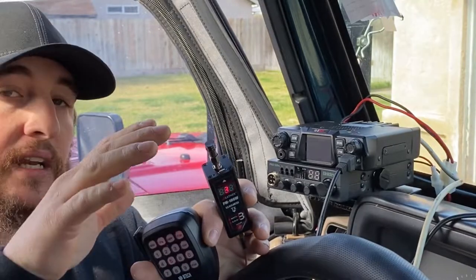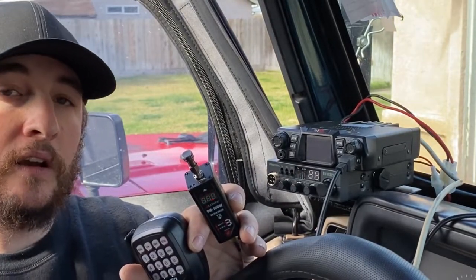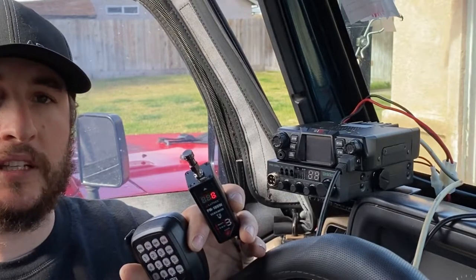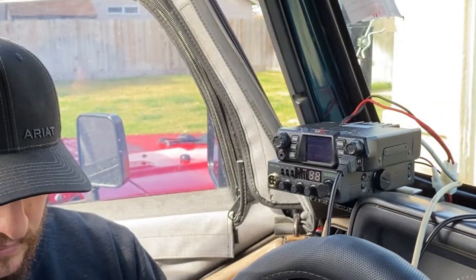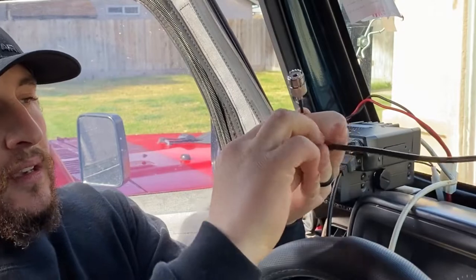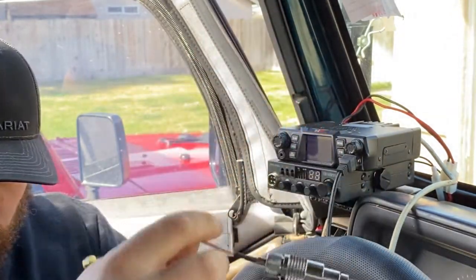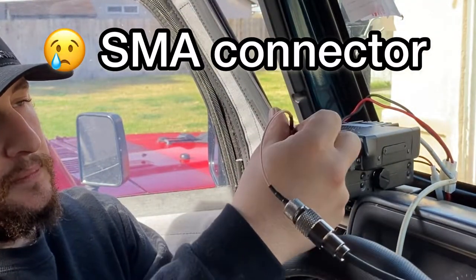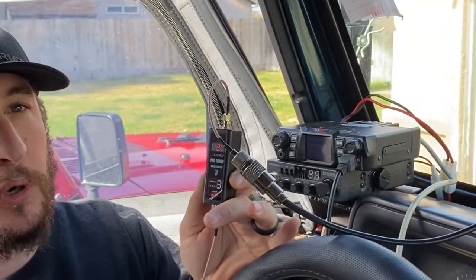Keep in mind the antenna is optimally paired for this radio, so there shouldn't be much tuning needed. However, it's critical to test SWR to confirm we're within range and verify output wattage. Switching over using the adapters — I plug in the cabling from the antenna into the female PL-259 to BNC adapter, remove the dummy load, and install the BNC connector. We're now fully connected to the antenna.